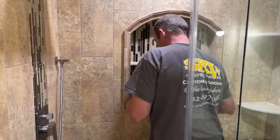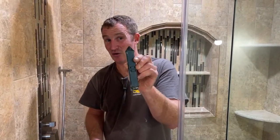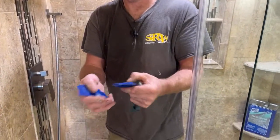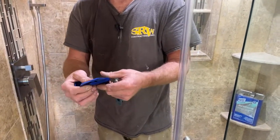The first thing is to have multiple tools. This is just a standard one that I normally use — it's made by Anvil. I'll put these links in the description below. It's a couple of dollars and has two different size tips. I also like to have these on hand — just a kit that you can get off Amazon with all the different sizes. Most of them are not going to be worth anything, but it's worth having just in case. One of the hardest caulking joints to do is like something like subway tile, because you have 50 different grout joints going all the way down the wall, and it's always really tough getting a nice smooth corner with all those grout joints.